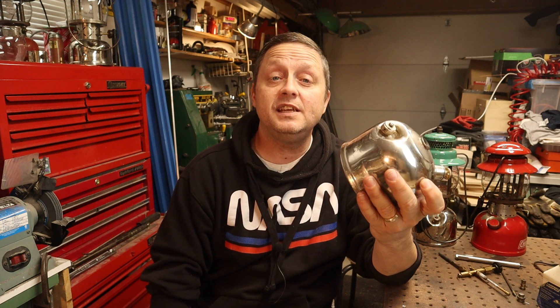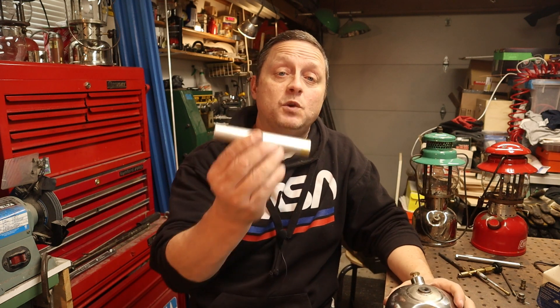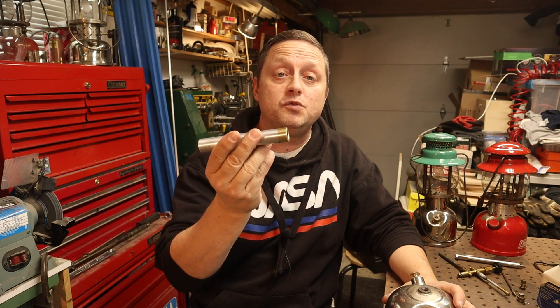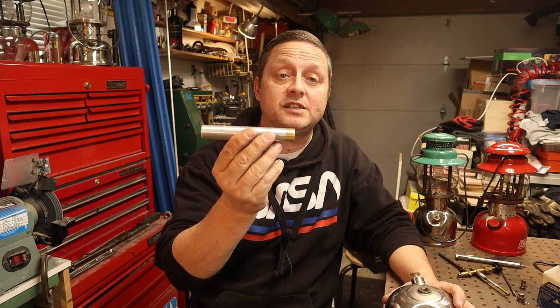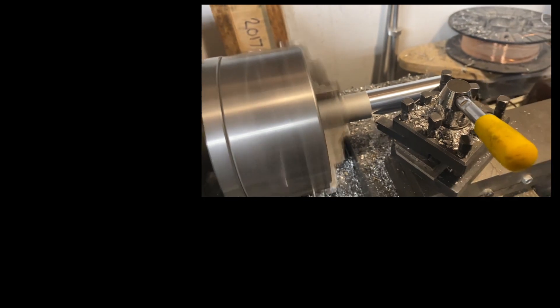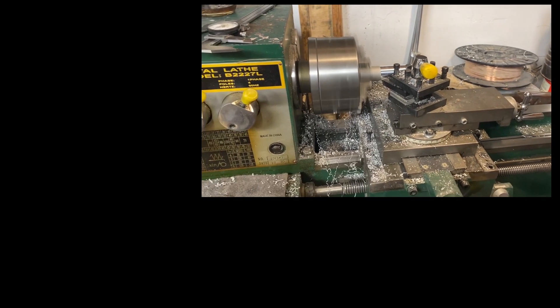I hope you found this insightful — understanding why you can't put any air into your font. If you check your check valve and that's okay but you still can't push any air in, then your air tube is something you may want to look at. It's not a common issue, but it is an issue with these older lanterns. If you want something like this, please let me know — leave a comment below. I do make these in small batches for fellow collectors and friends, and I don't have an issue making one for you either. Thanks for watching — we'll see you in the next video.